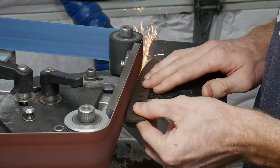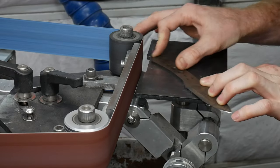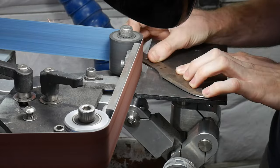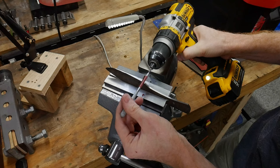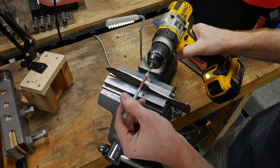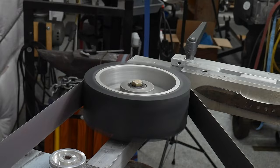After my tempering cycles I started on my blade cleanup. I like to get the profile ground to around 320 grit before starting on the flats — the horizontal capability of a 2x72 really helps speed up this process and I got all the scratches headed in the right direction. To clean up the sharpening choil, I wrapped some sandpaper around a needle file to run on my drill.